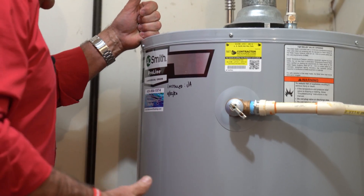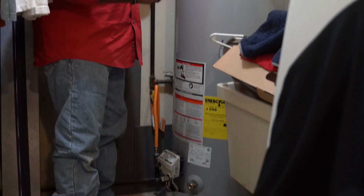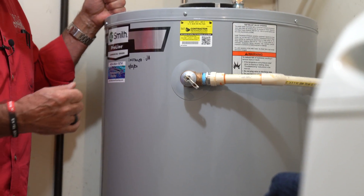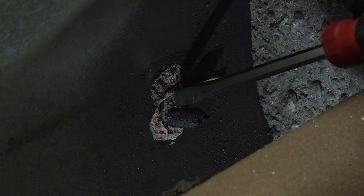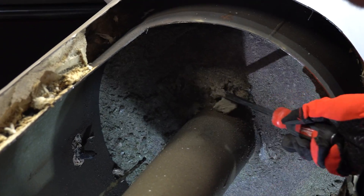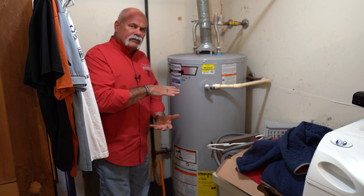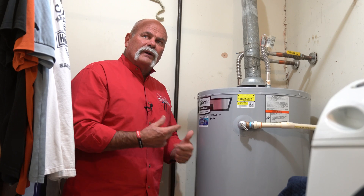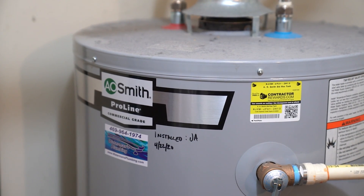Right now this looks really, really good. I don't see anything wrong. Drain pan set up the exact same way. The T&P valve has proper fall on it here. The main thing I think about is why do you flush? Well, we've got hard water here in North Central Texas, and there's a lot of calcium and magnesium in it. That sediment will fill up the bottom of the water heater and make it less efficient. If you get 12 inches of calcium and magnesium buildup in the bottom, that's going to take up about 15% of your water heater. A lot of your energy is spent heating up that calcium and magnesium. This water heater is less than four years old, so we will probably go ahead and flush it.